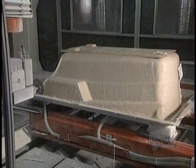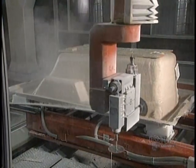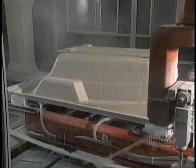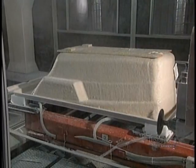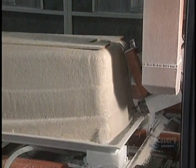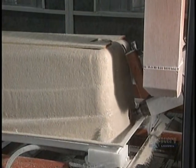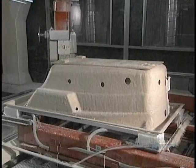The shell is then transported to the milling department. The shell is now dry and hard. They can extract it manually, but here they use digitally controlled machines. The operation begins with the trimming of the edges of the bathtub. During this operation, the robot will also pierce openings for the drains, the whirlpool jets, and the air jets for the overflow as well as for ambiance light.